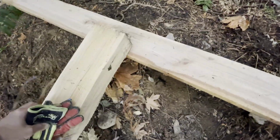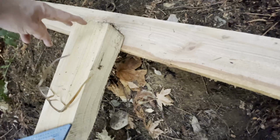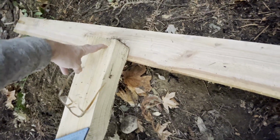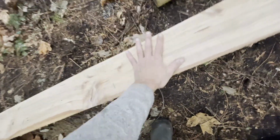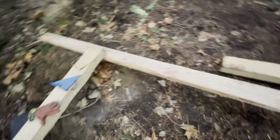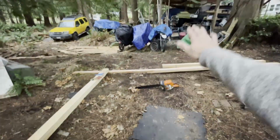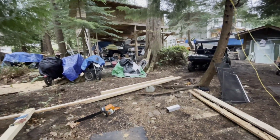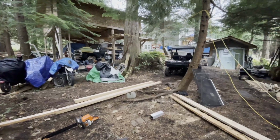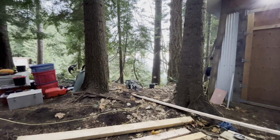And here's the plan. I'm going to take this and cut a notch in it that the 2x6 will slide into. I'll then drill 2 holes and put 2 lag screws through that. Then we'll add a 45 degree, same thing, it'll butt against that end, and here it'll be slotted and drilled into here. That'll help keep the corners at 45. And when we've got this assembled as a big U, I'll tilt it into the air and support it vertically. And then do the second one, put the metal on it, call it a shelter. That's the rough plan. So far the rain's holding off. It's been decent so far. Pleasantly so, and I'm hoping it holds.